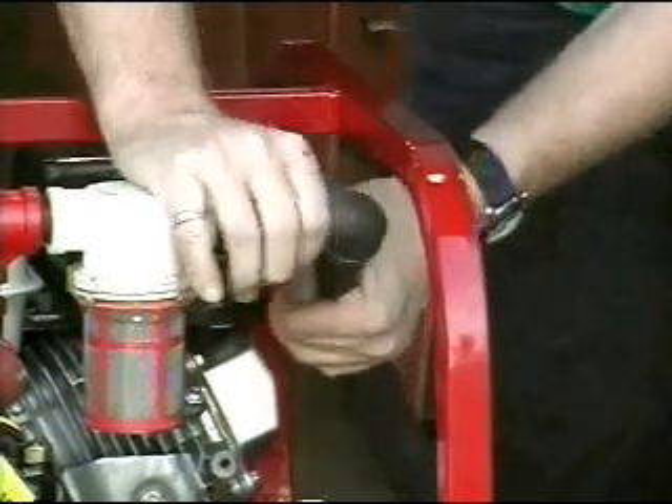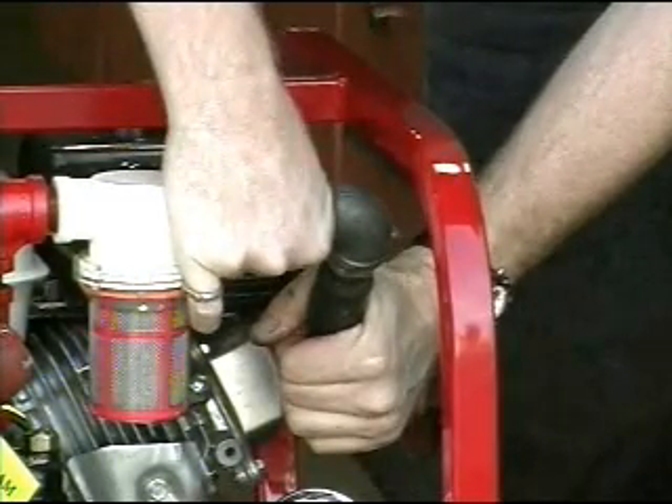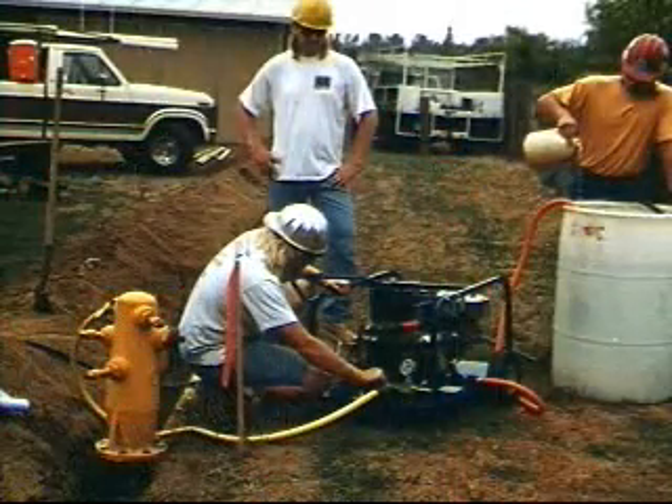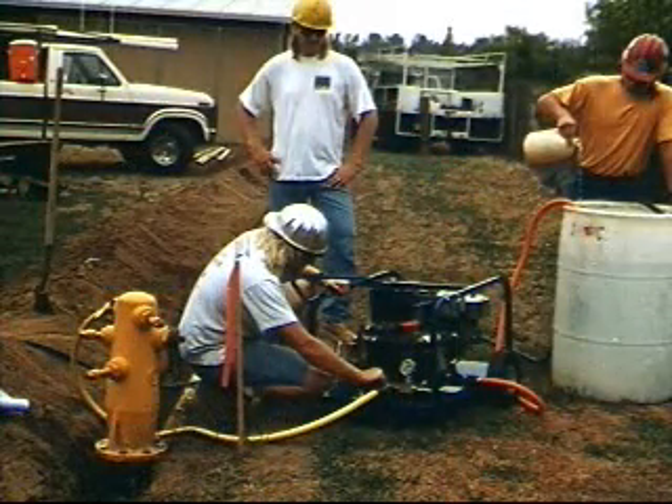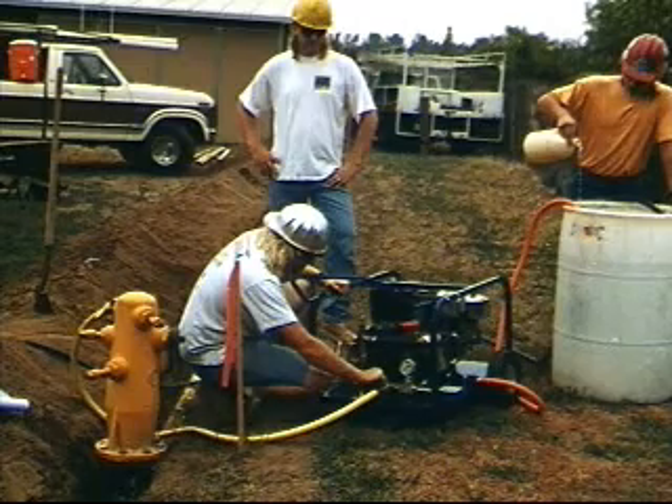Second, hooking up the pump. Connect the pump to your water supply. Make sure all connections are tight and that there are no leaks. For suction or gravity feed models such as the DP2B, in order to suction feed properly, the pump must not be more than 8 feet from the water source. Always make sure there is an adequate supply of water.